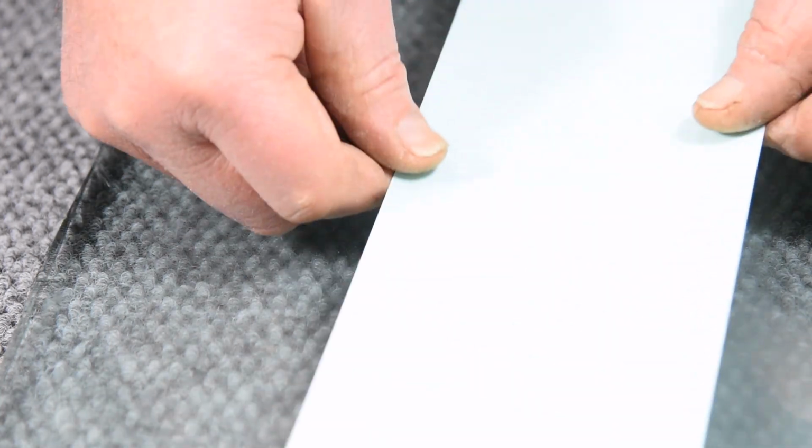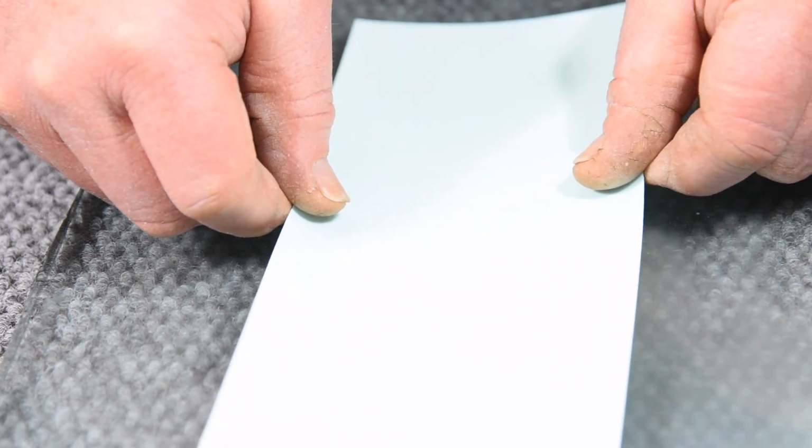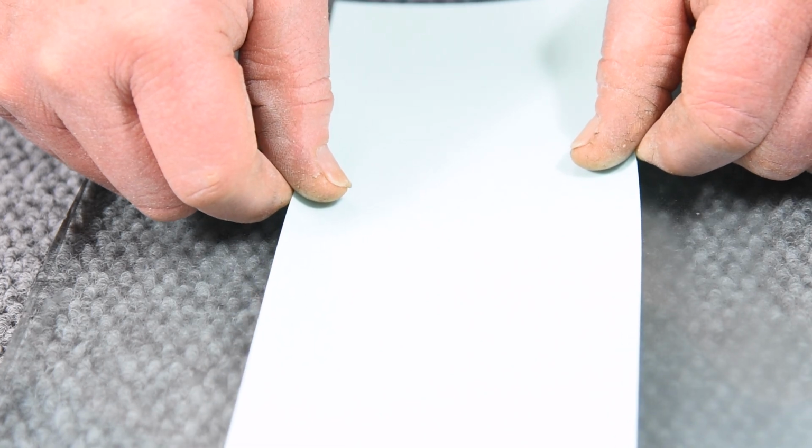Yeah, zoom in a little bit and get focused. And we'll give it a spray off with an air hose and spray the paper off also. The paper meaning lapping film. And then it's very simple to feel if there's anything underneath there stuck between them. I got a pretty clean job on this.